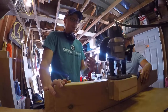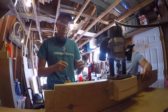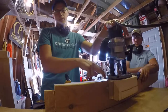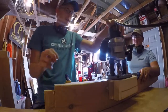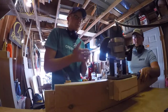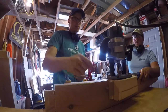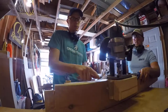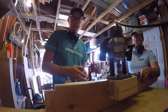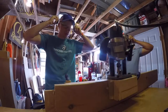Then we're going to slot out this bottom rail to slide those into, to give it a little more stability and kind of make it all centered. We've got this set up here with the spacing so the router is going to be cutting this slot directly in the center of this bottom rail. For the other rails — the tops and bottoms — I'll just be doing holes for each individual slat to go into, since there will be some spacing in between. Without further ado, let's get to it — I brought some reinforcements in too.